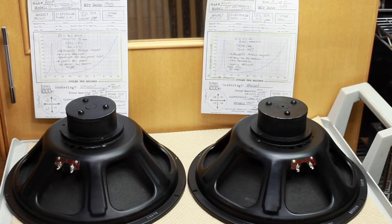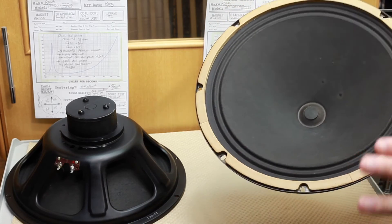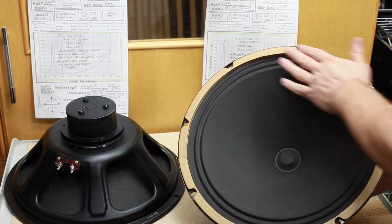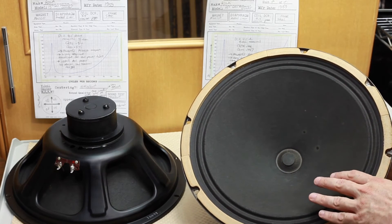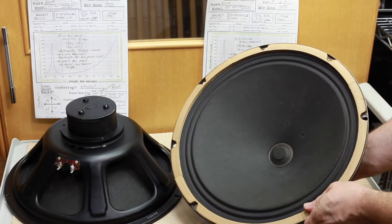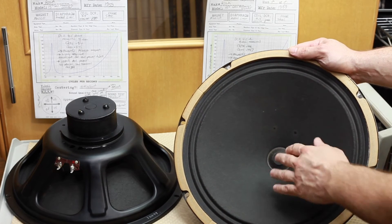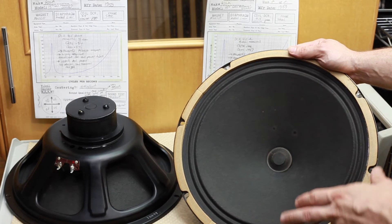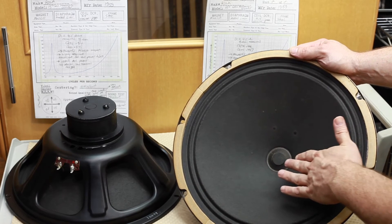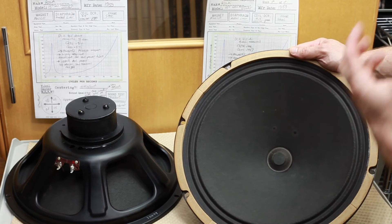They weren't used in hi-fi yet. When I flip these over, you'll notice what makes these really a great consideration for audiophiles — they're all paper. They're a low-excursion cone, so they're fast and suitable for an open baffle. To cut out any high-frequency reproduction from the center dust cap — which in a 15-inch Jensen would radiate a lot of high frequencies — on these, they did a treatment out of some kind of linen, heavy and covering the center of the dust cap.